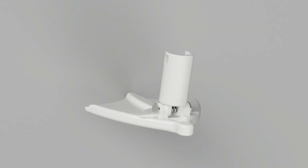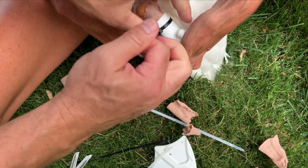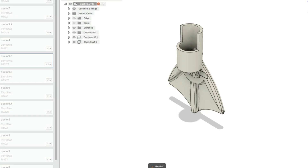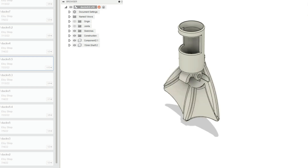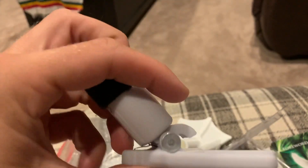Following the unsuccessful visit it was time to go back to the drawing board. First, to solve the rotation problem, the solution was to either zip tie the shaft around the duck's ankle area or widen the velcro strip to create greater surface area of contact. I increased the length of the leg shaft to surround most of the leg for more contact and less rotation. Second, I added an extrusion in the virtual model to create a hard stop which would prevent the shaft from making an angle greater than 80 degrees with the foot.